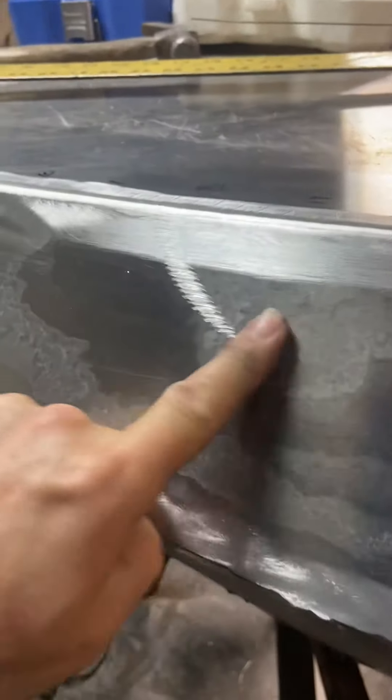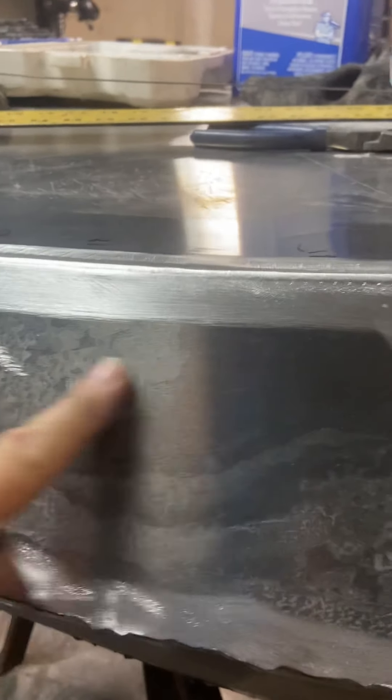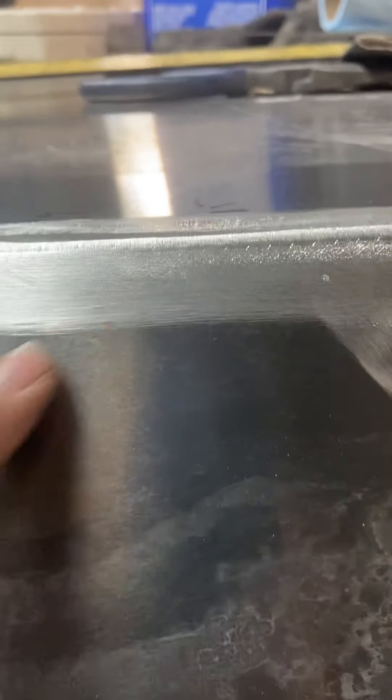That's how I did the last boat — taped off all the seams and then just did one direction of hand sanding. Not very fun, but I thought I'd share that little tip. Somebody from New Zealand asked me how I do that, so I figured I'd let everybody in on it. Hopefully it does give it a very nice look. If you can work the sandpaper right down to the tape, you get a nice crisp line. This aluminum had been sitting outside so it's already weathering a bit. Anyway, thanks for watching — if you like what you're seeing, hit that like button and please subscribe. I'm doing this for fun and hopefully sharing a little bit of knowledge and tips and tricks.